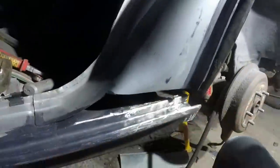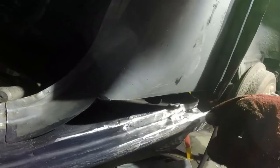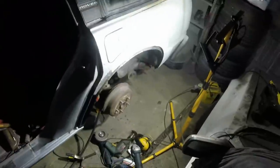So that's welded in now. The top - I'm not going to bother rubbing down anymore because all I'll do is lose strength. You're never going to see it as long as it's protected, good enough for me. That's all nice and smooth - with a tiny skim of filler it'll be fine. This bit will be all hidden behind where that panel comes down and welds to it, and then the rear bit is all lost behind the outer wing. I'm going to get some zinc now and toss that in there, then get on with the final prep and start tacking in that rear inner wheel well. It's not perfect by any means but compared to the rusty holes we had previously - that's all solid metal, decent protection and a good basis for welding back onto.